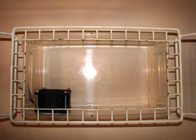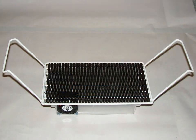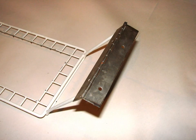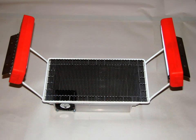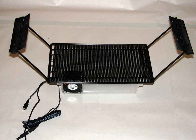You have to get the centering in mind because when you're done you'll put silicone sealant on it and pull it all down. You can see the screw holes on the bottom center and top center, with a couple screws on the sides. Get about 18 inches of piano hinge at the hardware store, cut it, and put pieces on each side. It's double-sticky-taped on, and eventually I put a piece of wood underneath and pulled it down with two screws so you can mount any lights you want. I tried battery-powered LED lights but they were slightly off color, so I couldn't use them.